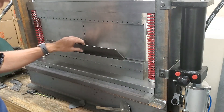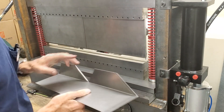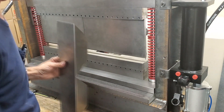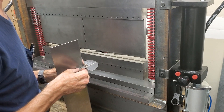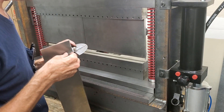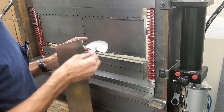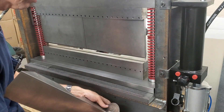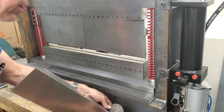It's hit the stops here. Let me take this out and see what we got — it looks pretty good. Let me put the protractor on here. You've got to do both ends though. It's like 90... 90 and a half. That's pretty close. See the other side — yeah, it's right on there. Angle looks good.